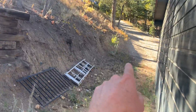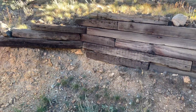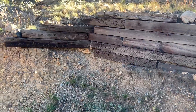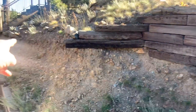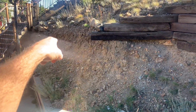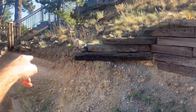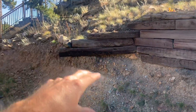It's difficult access, so we would need to come in through here with the mini excavator and then remove this wall here. Flatten ourselves out a little spot that we could reach all the way back in there, and then we would start installing. We would dig out a bit right through there and do a key line for our boulder foundation — essentially trench out and cut a flat spot to start placing the boulders.